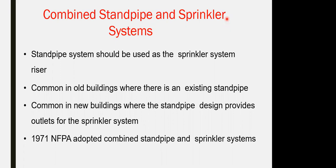Design parameters. You decided. And in many cases, the IFC drawings come to me from the tender, from the consultant, as a two-pipe system. During construction, I make a calculation and submit, and start applying a combined system with cost impact or value engineering, whatever it is. It changes the system, saving time and cost for installation, maintenance, accessories, etc. Commercially, if it is applicable, it's not mandatory. So why should I waste money on pipe for no use? So you can combine both together.